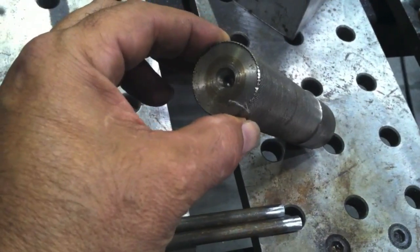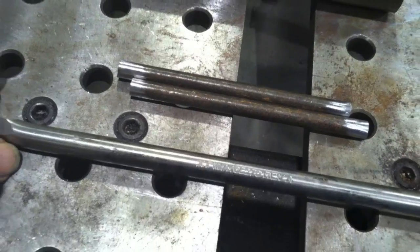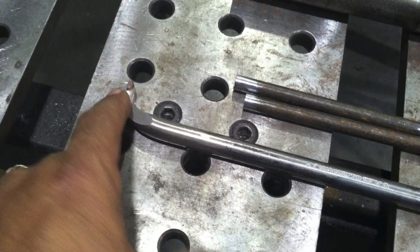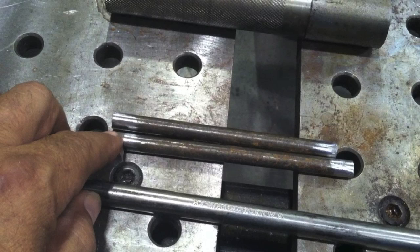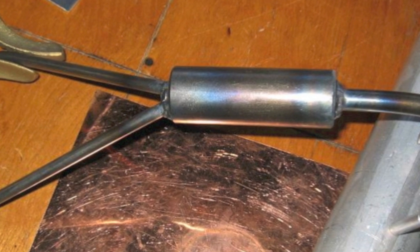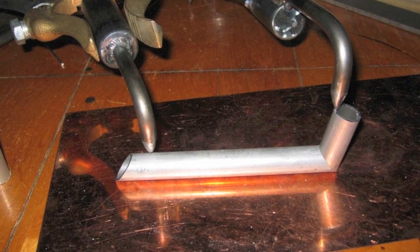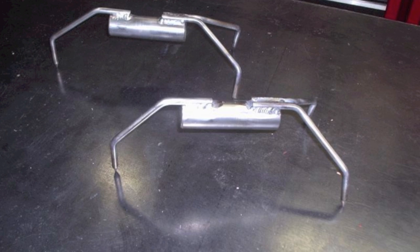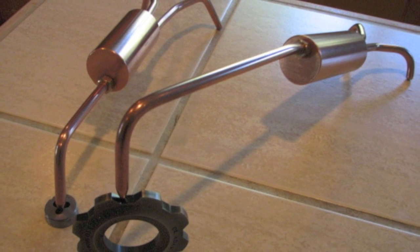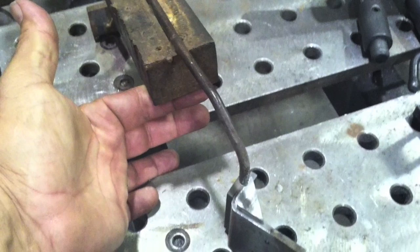Now for making the third hand — I just grabbed some stuff that was laying around. Here's a piece of something that was knurled, a couple pieces of round stock. This was going to be a special tool of some kind and got scrapped out, but it's got a little hook on it already that was bent and then machined flat. Here's a third hand just made out of a piece of scrap round stock — looks kind of cool. I pulled these off pictures from my welding forum at forum.weldingtipsandtricks.com. These are really cool, they almost look like bugs. And this is taking it to the next level — solid copper, machined and threaded and everything. This one looks like crap but still works. So let's get into making one. I'm going to use some silicon bronze here.